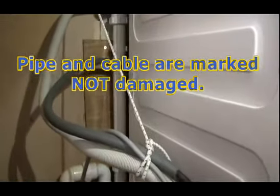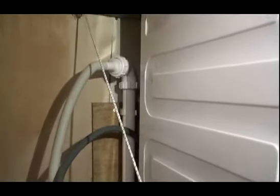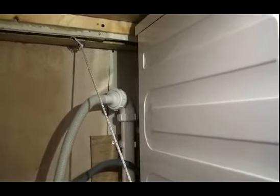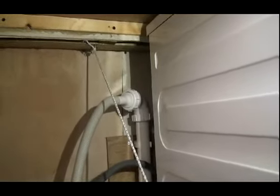These hoses were trapped behind the dishwasher, and there was also concern that the hose was too short to reach into the dishwasher upstand. So we've extended that upstand by putting on a compression elbow and a washing machine connection, so that the hose goes in in a more secure way and when it's pulled out it extends out fully.